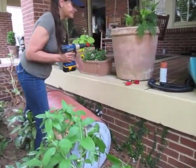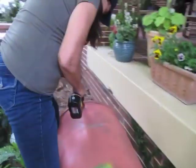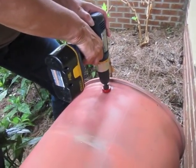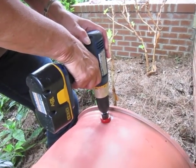I drill the spigots for my class participants. It is important to make sure the spigot is tight and secure. I use a 1 and 1/4 inch Forstner bit for this purpose — it gives my spigot holes a nice tight fit with the spigot fitting. I do not screw in the faucet; I leave this for the student at home. You do not want to stress the spigot during transport.